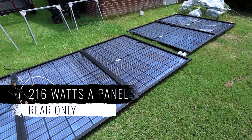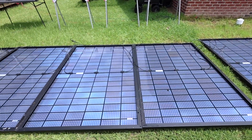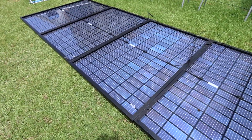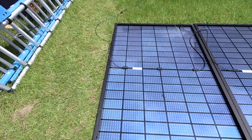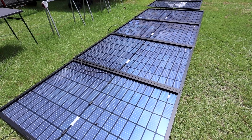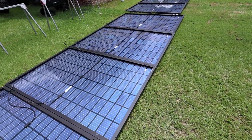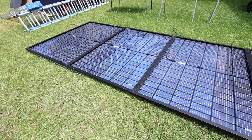Let's do the calculations. Right now pulling in about 216 watts off the rear of each panel — that's definitely above what they're rated for on the bifacial part. Of course the bifacial portion relies on reflected light, but if you've got a concrete surface, white rocks, or snow, the back of these panels are going to do outstanding. The rear is only rated for a maximum of 124 watts under ideal conditions, so I'm not sure exactly how they conduct that testing.